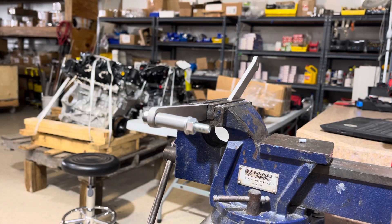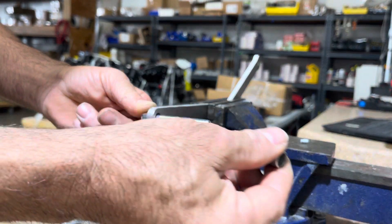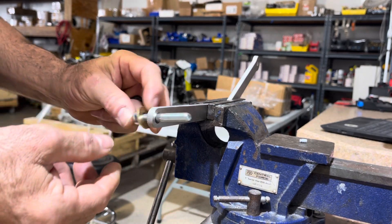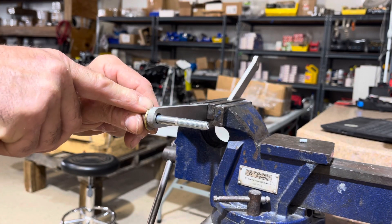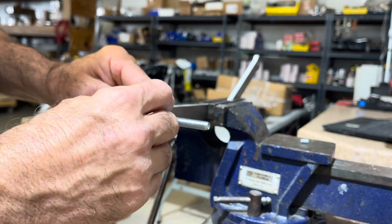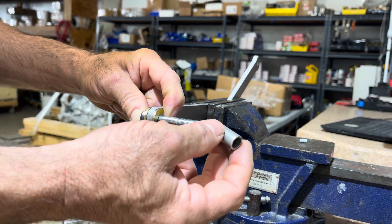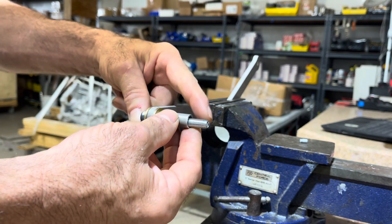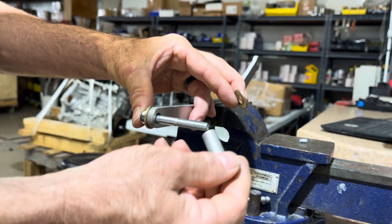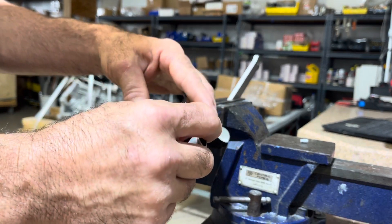The actual installation has a few more washers and things that kind of makes it confusing. There's a washer on this side, because the bolt goes up against aluminum normally. And AN3 washers — then there's another AN3 washer simulated with this one that goes on here. It just barely fits the bolt. And then there's a sleeve that goes on top of that out of steel. Notice it butts up against the steel washer, and that's its purpose — so that the steel with fairly skinny wall thickness doesn't dig in when we tighten it. The plans show it, so put that there.